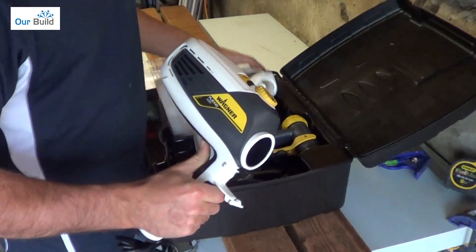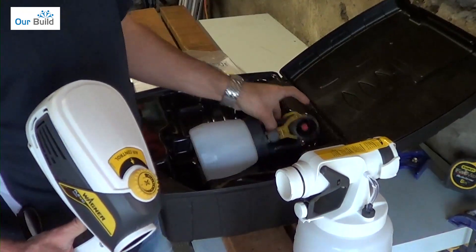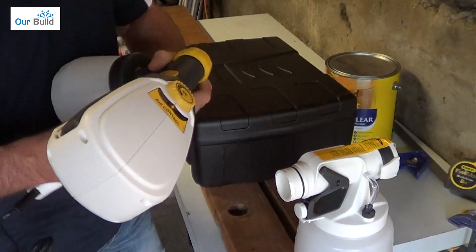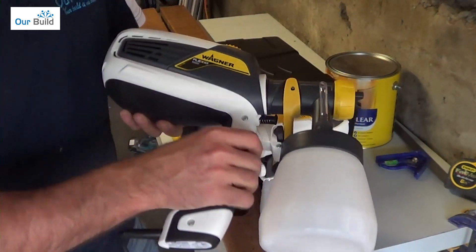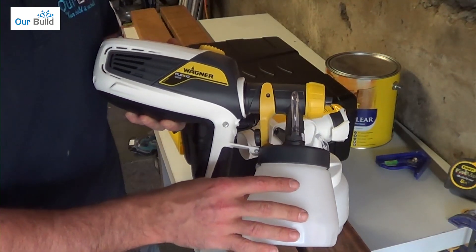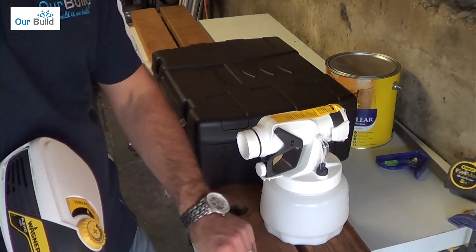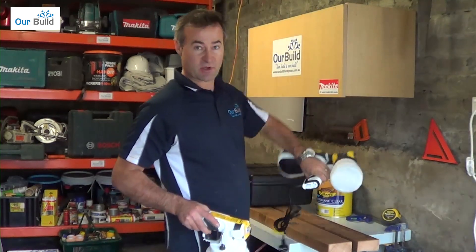Here's the main head unit. We've got two different types of spray bottles we can use. This is the large one, which is normally for wall paint. And then this is the smaller bottle which we use for fine spraying timber work — I'll probably use that today. This thing's been dubbed the hair dryer on steroids. There's no need for dilution of paint; you can just pour it straight in and it's good to go. The paint we're using today is polyurethane — a clear coat to finish off this timber.